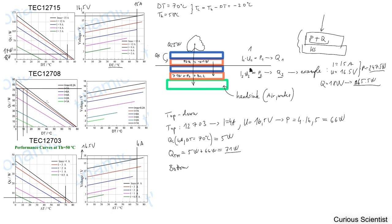For example, if the hot side is at 50°C and we bring it down to 35, then going from 35 with a 70 degree DT gives minus 35°C — not so good. I say we don't use the 8 ampere unit because it can't provide much DT. Also, if we used it as an intermediate stage with 8.2 amps at roughly 14 volts, that's around 102-105 watts, and 105 plus 71 is 170 watts, which would already max out the next stage.